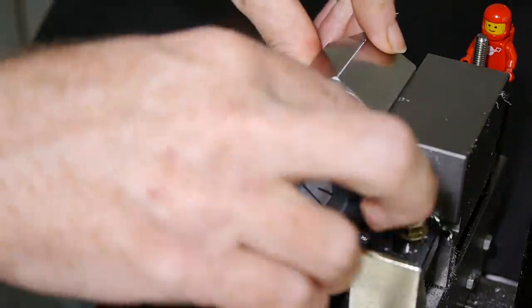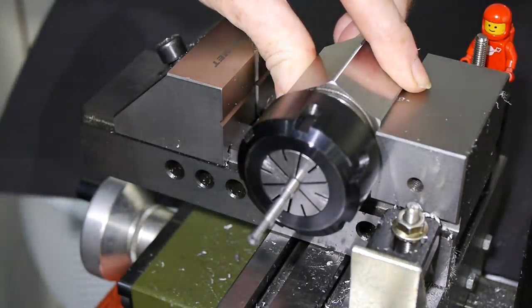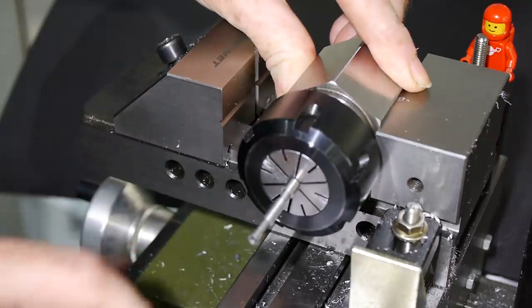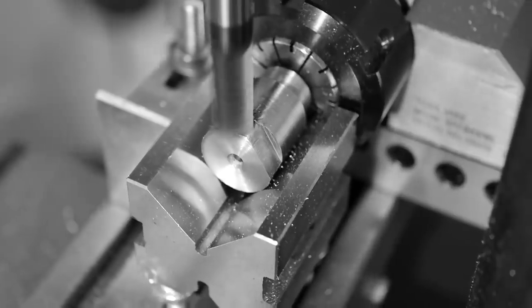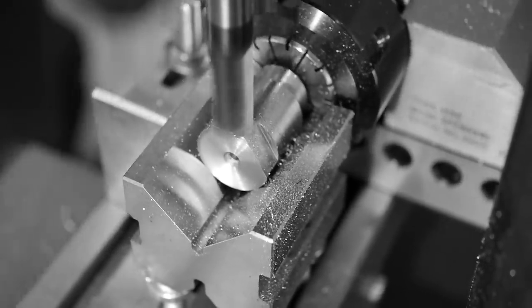A key feature in the tap geometry are the flutes, which define the cutting edges and allow chips to clear. For this tap, I plan to mill the flutes into the side, but the part is too thin to do this without supporting the far end. I've solved this problem before when milling hexes, but this part is much smaller and needs to be held more precisely.